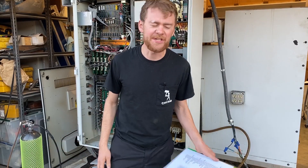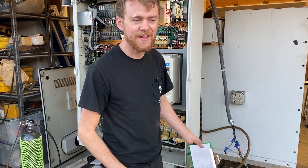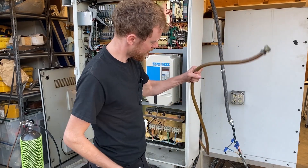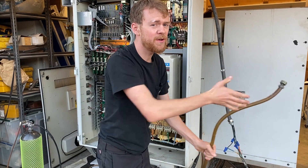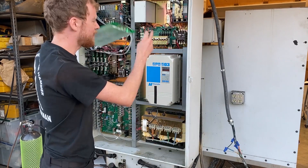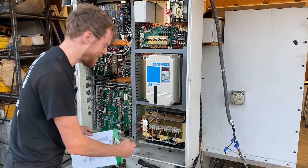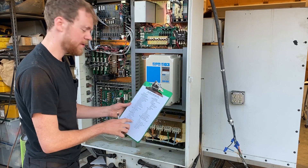Let's take a look at the back of the machine. First: does it have a coolant tank? Does it have a coolant pump? Is there coolant in there — can you run it and make sure it works? The coolant hose on this one is pretty much shot — I'd replace that. The other thing to look for is the entire electrical cabinet and everything in it. Below the electrical cabinet is the way lube, the air system, and behind that panel is underneath the Y-axis.